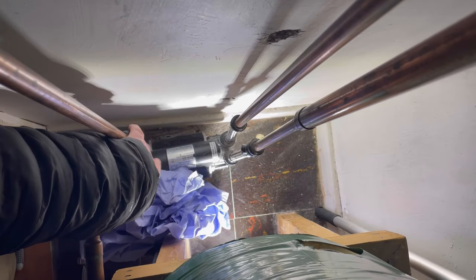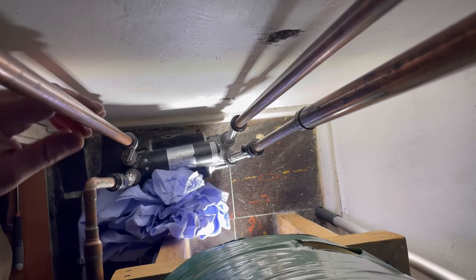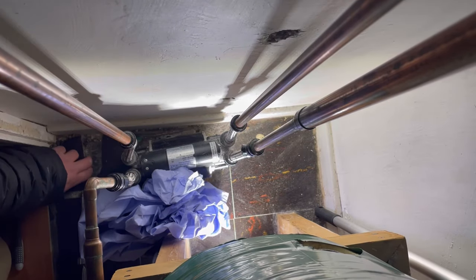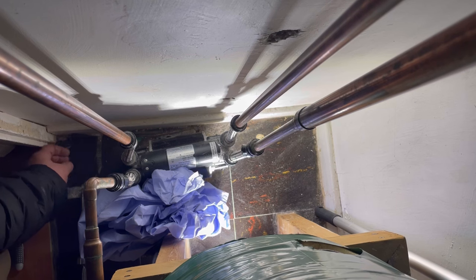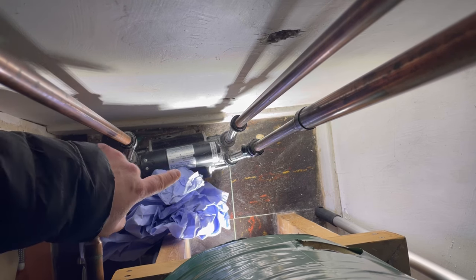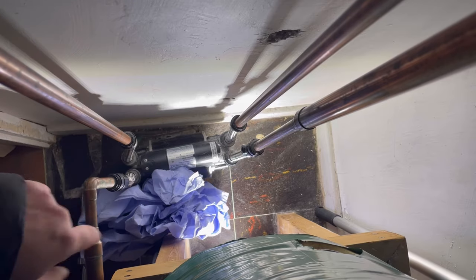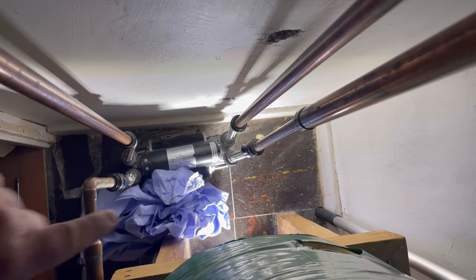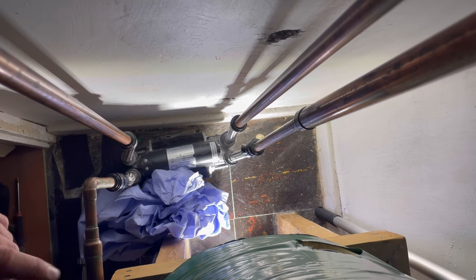Has anyone noticed what is wrong with the person who's drilled through here? Why shouldn't he have drilled through? Well, these are quite loose — these are Bakelite. Now there is asbestos in these, but it's more the black bitumen that holds them down where the majority of the asbestos is. So you don't really want to be drilling down through this stuff. Let's get this disconnected.